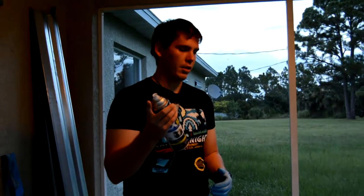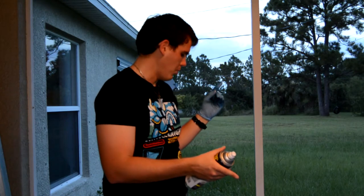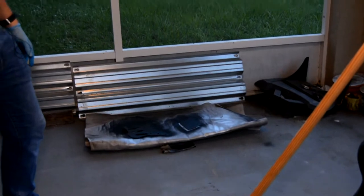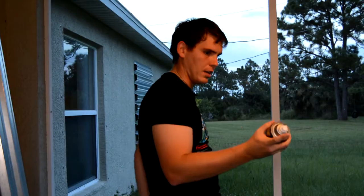We are at the stage where we've already gotten every piece of wood on here, and even the pick guard and back plate, to a 800-plus grit - which is two 800s rubbed together, so it's over 800. It took me hours, that's why it's dark now. And now we're putting the paint and primer on the guitar, so we're priming it before we do the hydro dip. We're painting all those blacks. This is the second coat - we did the first coat already. We're just trying to keep it nice and even.